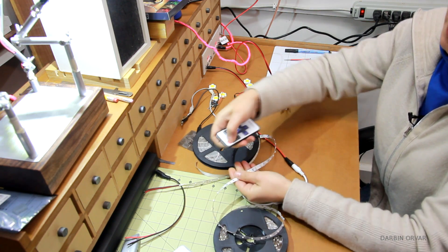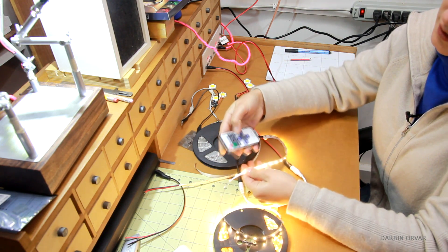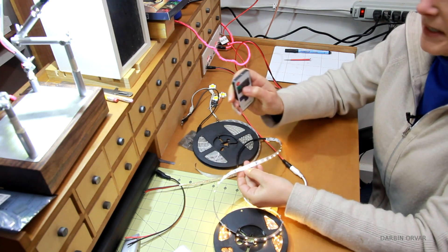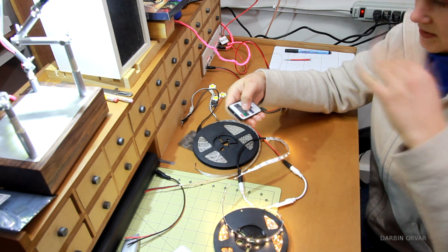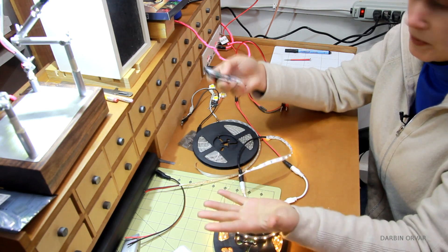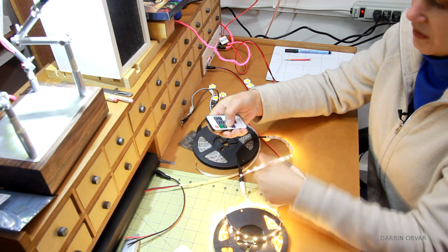Some of them come with this kind of remote, so you just turn that on. You can set the percentage — maybe 50% dimmer or 25% dimmer. This is a PWM dimmer, which you can see on camera because the frame rate gets a little messed up with it and it shuts on and off really quickly. But for most projects you won't see that, and they work just fine.